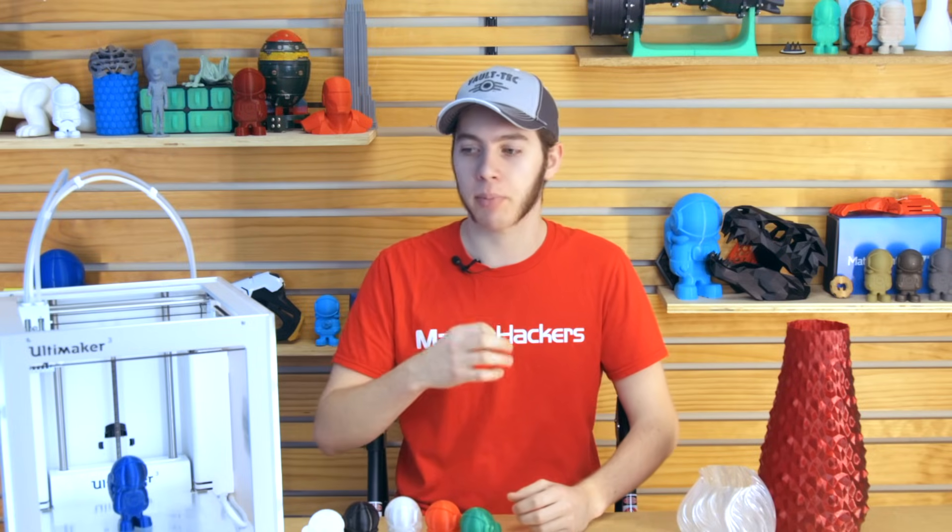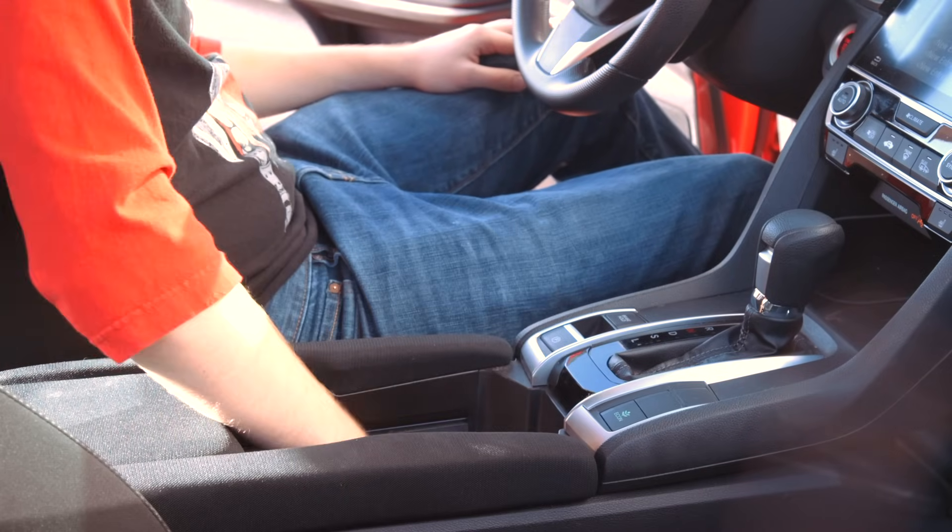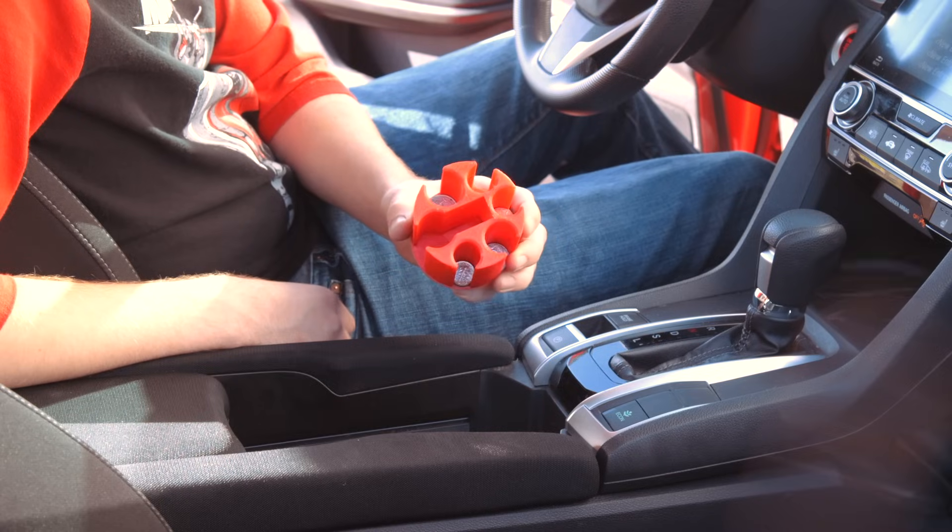You could even put a coupling on the side of the bin and print directly from it. PETG is a pretty versatile material. A lot of 3D printer companies use it for the printed parts of their machines. I have a PETG coin sorter cup holder in my car and car hooks in the back seat. In California with heat waves, it gets really hot in the car, and PETG ensures your parts won't droop or wilt. It's pretty easy to print with and I see it having a more prevalent place in 3D printing in the near future. Hopefully the tips in this video are enough for you to get started with PETG. If there are tips or tricks I've missed, feel free to leave a comment below. Thanks for watching!